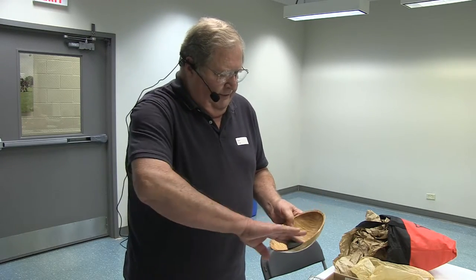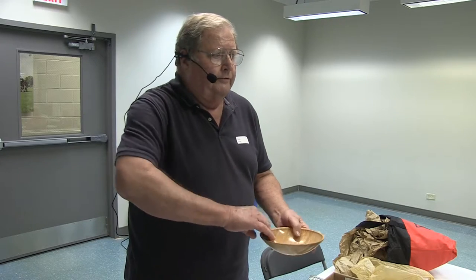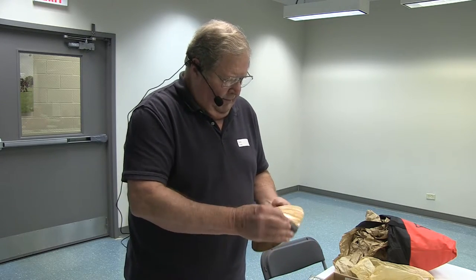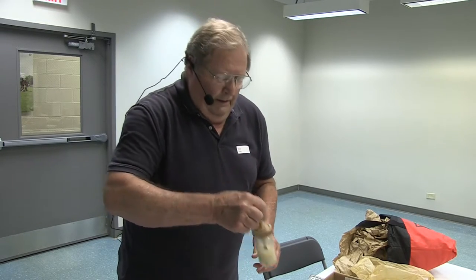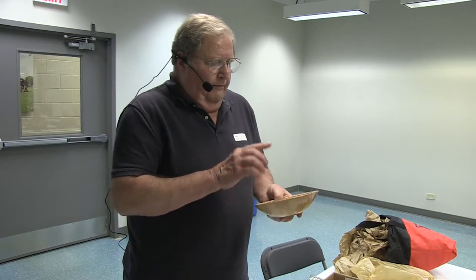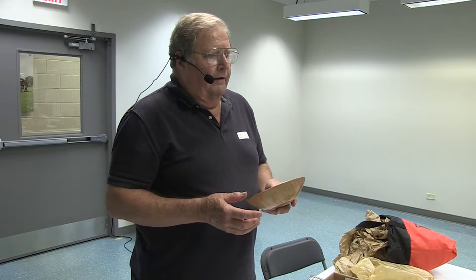Now, I would just keep this wet for a little bit and make sure that it's not soaking in anywhere. If it's soaking in somewhere, keep at it. But I doubt this piece of paper is soaking up anything here. I don't see anything. It becomes dull looking. Everything's shiny, and all of a sudden you'll have this patch of dull stuff where it's soaked in and lost its sheen. I've had some relatively thin pieces where I would see it soaking in on this side, and turn around and look and it's starting to come out the other side. That's not the best of old wood, but it was pretty.